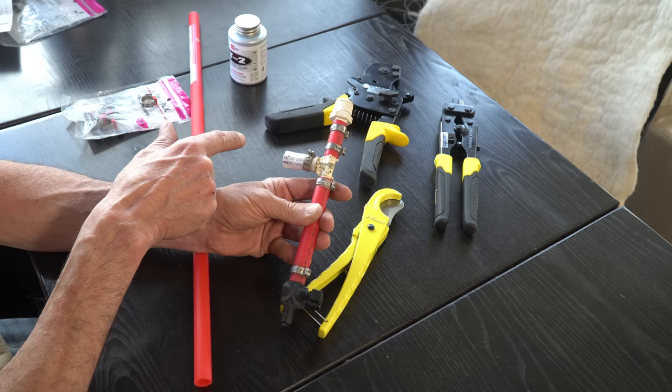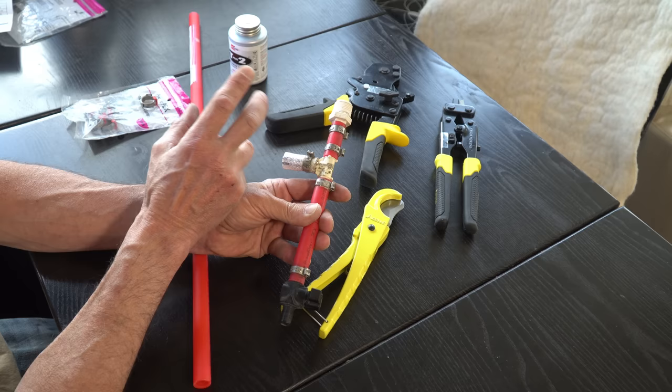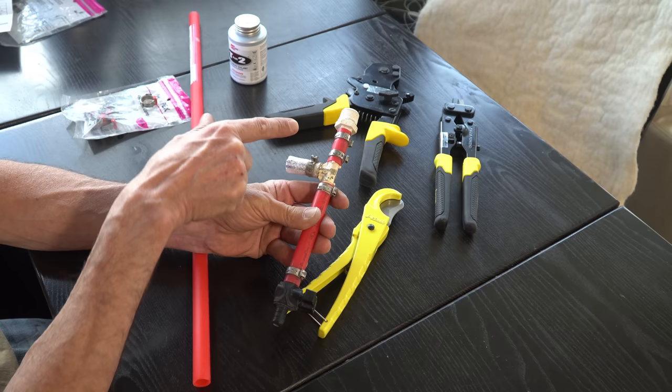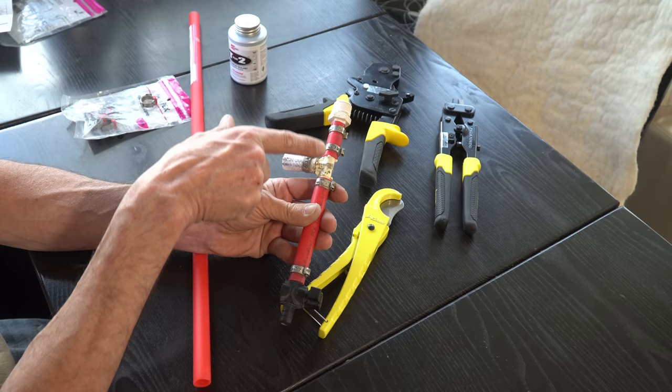Once Kelly took a look at where our tank fitting was cracked along the edge of the fitting, rather than drill a larger hole and put a larger fitting in, Kelly decided it would probably be best, and I agree with him, to weld the polyethylene crack. So he's gonna weld that crack closed to the point where it'll actually be stronger than it was before it cracked. I wanna get rid of this T. So I'm also having Kelly install an identical fitting in the tank right next to it for filling and emptying the water tank. We'll still use a system like this on this fitting as our drain.